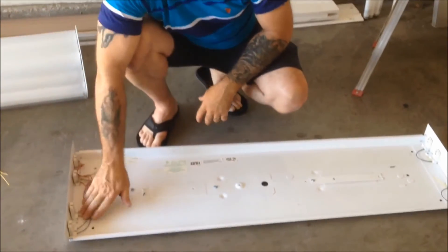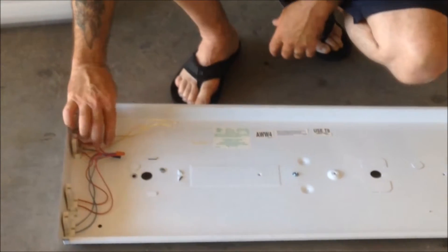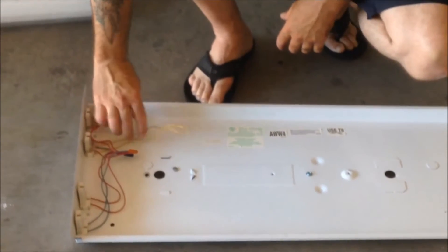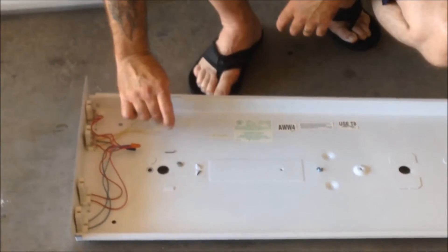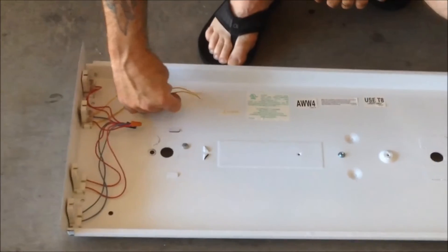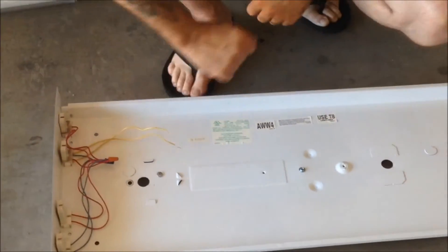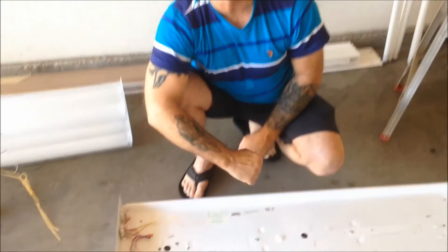On our tombstones, you can see each one has two wires. We've wired them so the hot goes to one side of the tombstone and the neutral goes to the other. So we've got our two wires here that we're going to use to feed power to the LED lights on one side. Now we've got our light fixture ready — it's all set — and we're going to go ahead and put it up in the ceiling and wire it up.